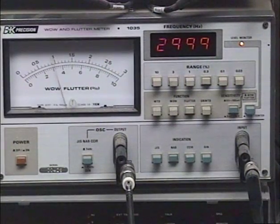And incidentally, the wow and flutter on this machine, in which I replaced the motor, is right at 0.1%. That's a tenth of 1% wow and flutter. The specification on the Akai CR81D specifies the target, as I explained in the last video, the target is 0.25% or less, but they only guarantee it 0.35% or less.